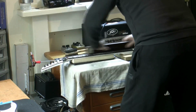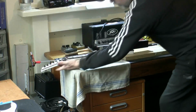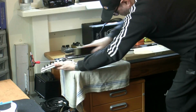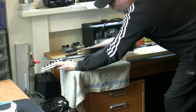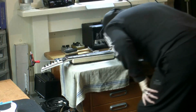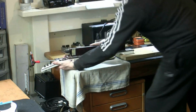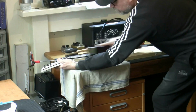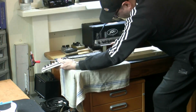And it's going to take a while because some frets are higher than others and we need to level a lot of the frets. We'll let the leveler do the work. See where we are. We've still got pen in these areas down here, so quite a bit to go yet. I'm going to hold the neck because it was moving slightly. Like I say, let the leveling beam do the work. This way I know I'm going to get a consistent level across all of the frets because I don't stop till all the pen's gone.